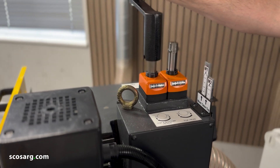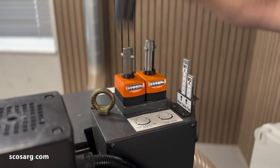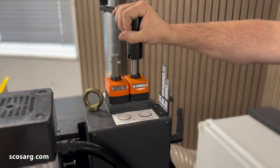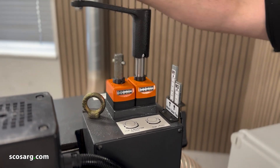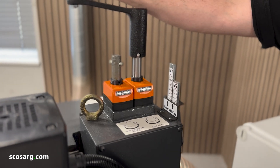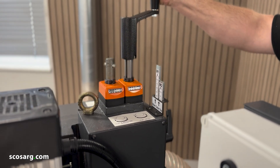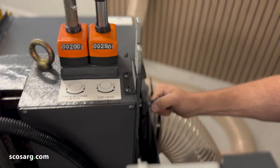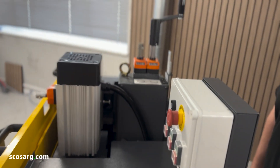We're just going to set the first step at 20mm. You can then remove the handle and pop it onto the adjustment for the top head alone. We'll then adjust that to give us whatever tenon thickness we require — we're just going to set that to 25 millimeters. We can then lock both handles off, and our tenon height and thickness is set.